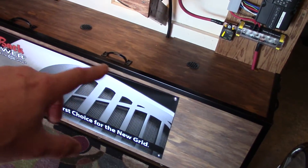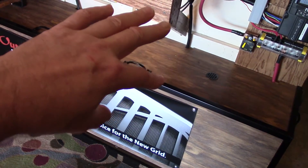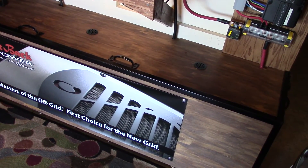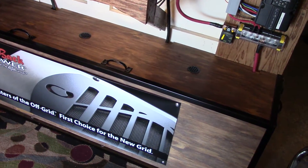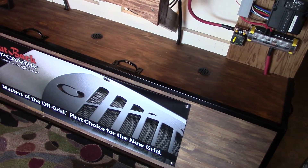This box I made is for safety — so I don't drop a tool between the negative and positive terminals and create a 10,000-amp arc, fire, and explosion. Safety first. It's a safety box with some ventilation, and I've got Water Miser caps in there which trap a lot of the gassing, so I have no worries about explosions or hydrogen leaks.